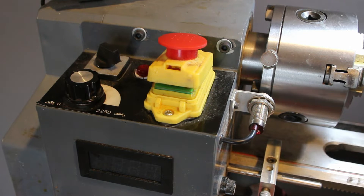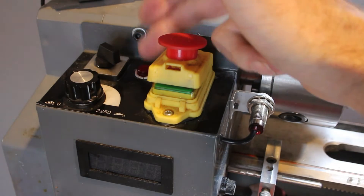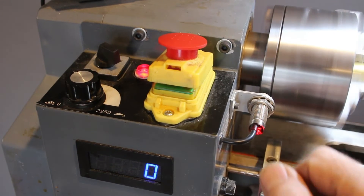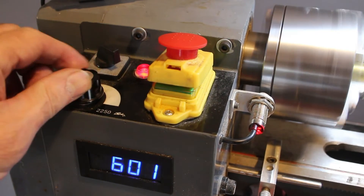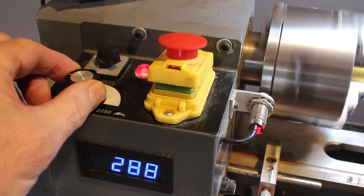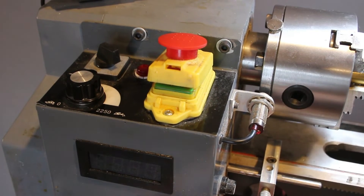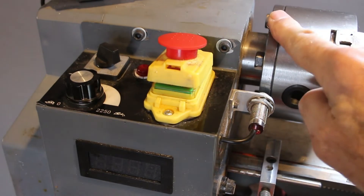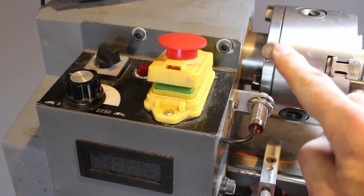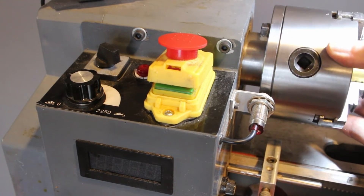Another improvement I made was to install a tachometer here, which comes on the moment I start the machine. I also put a red light on here that comes on when the machine's running, just to make sure I can see that it is on — because you can start the machine but if you set the speed so low you don't know it's actually turned on. There's a sensor that comes with the kit. This is a very inexpensive kit, and you mount a magnet somewhere on your rotating part. I glued this on with thickened crazy glue and it's really bonded on there very well. It has to be close enough that it can see the magnet as it goes by.